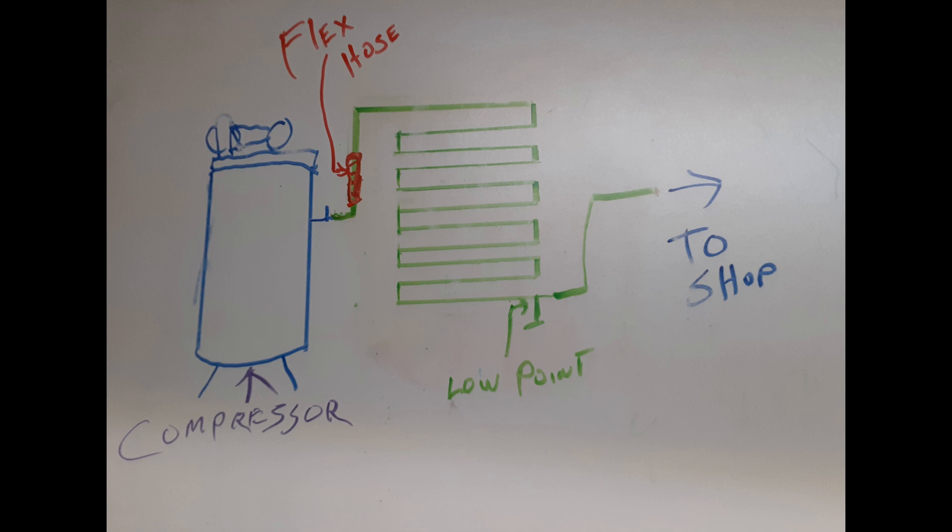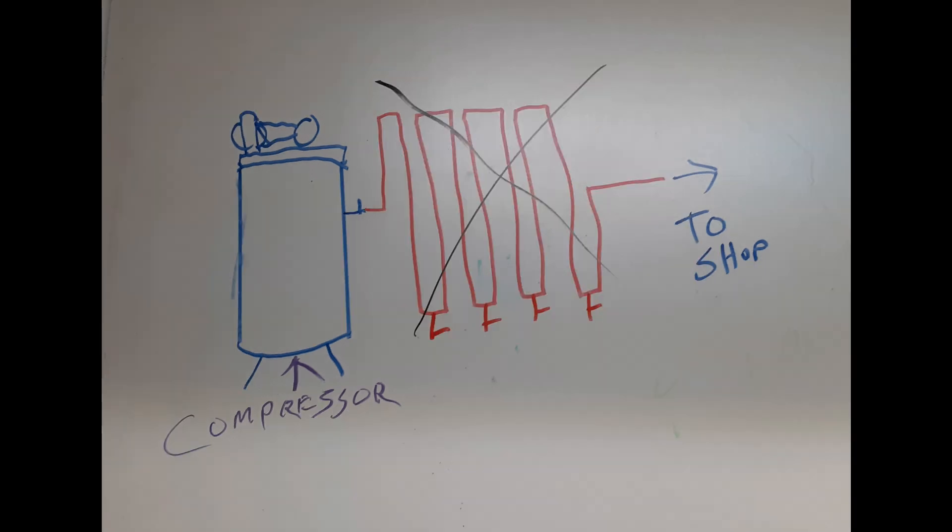One more thing about this type of manifold: you'll notice that I drew in a flex hose. I'm the artist on the drawings — yes, I'm that bad. You always want to have a flex hose coming off your compressor, especially if you're going to a black iron pipe system. This will protect the welds on your compressor from breaking due to vibration. If you run your pipe to the wall and make it solid, you stand a chance of breaking a weld in the tank from vibration with the pipe bolted to the wall. Seldom do I see guys using flex hose, and these guys are all over the Internet showing you how to build these manifolds, but almost every one of them does it vertically.